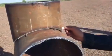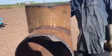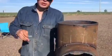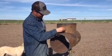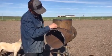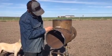So right in the throat, and then in both the same spots. So, stay right there. When you go to tack this up, make sure that your tacks are on the outside of these. You're gonna run a tack right here. This is where your strap's gonna come out of. Make sure your tacks are on the outside.